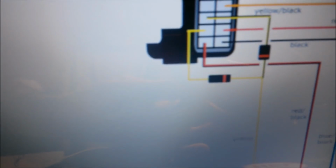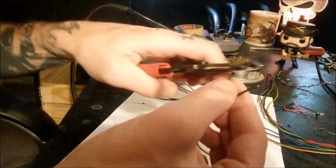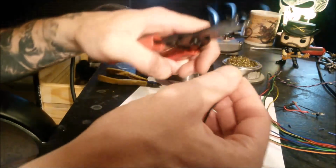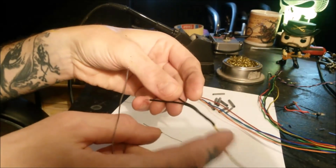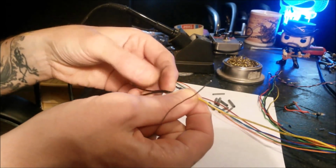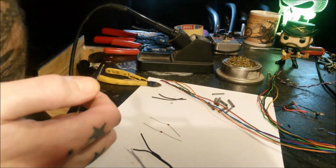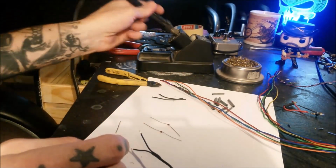Yes. So actually I'll probably do it. So it kind of looks like that. I think I probably could have just soldered the two diodes, the ends together, and then had the wires coming out, but I think it'll be nicer to have it in line. Plus actually it wouldn't have worked because that yellow wire wasn't soldering very well. I wouldn't really have wanted to put those two together, the legs, and then try to crimp them. So yeah, there we go, it's all worked out.